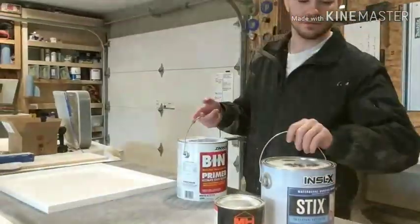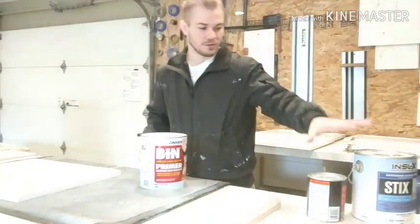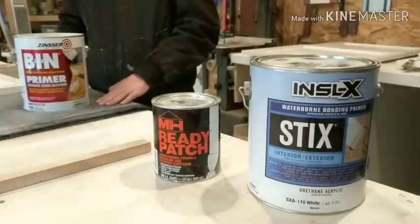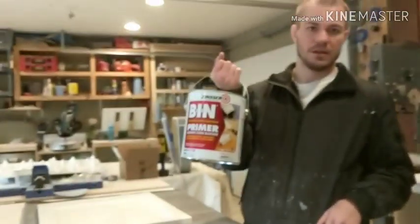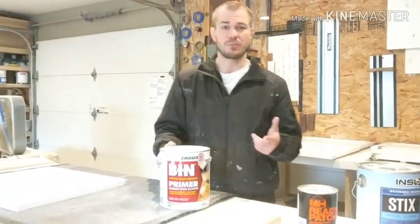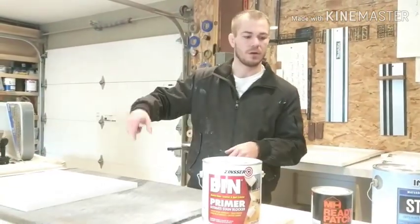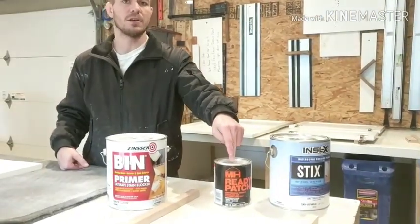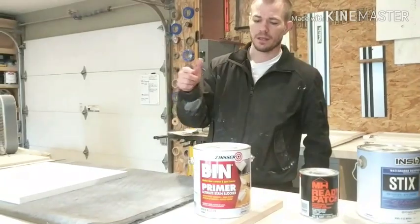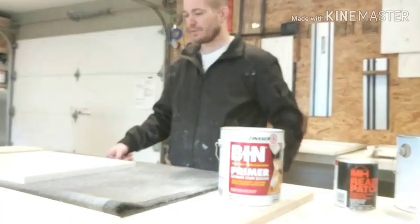Finally, if you need to block stains — because most of these golden oak cabinets are stained — after doing two coats of bonding primer with sanding in between, then filling with MH Ready Patch and sanding that back down, you need to hit it with a shellac-based stain-blocking primer. If you have an airless sprayer but don't want to deal with shellac contamination and fish-eye issues, you can just get an aerosol can and spot-prime all the top. You have to prime the spackling compound if you want a good finish — hit it with the aerosol or a stain-blocking primer. ProBlock from Sherwin-Williams is another great one.